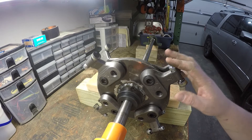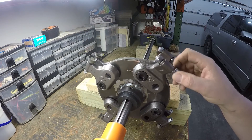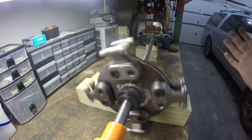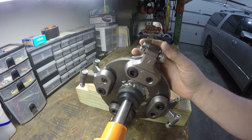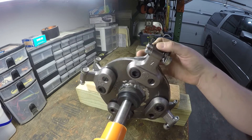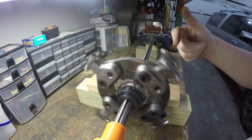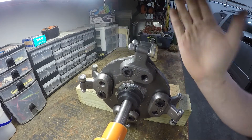Here she is in all her glory. That click and sound you hear is the cutter heads — I didn't fully tighten them because these are lock nuts and I didn't want to wear out the nylon by taking them on and off a couple times. I still got to paint this, so it's going to come back apart, but I just had to see it fully assembled. This thing ended up weighing about 20 pounds — a little more than I originally thought — but I was going for mass and speed and I definitely got mass. We're going to run two tests: I'm going to see how far out of round it is, how much it goes up and down when I spin it, and I'm also going to check for end play — how much it moves laterally left to right.